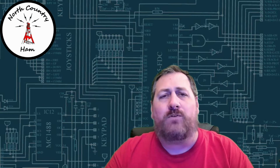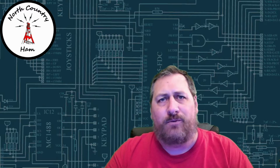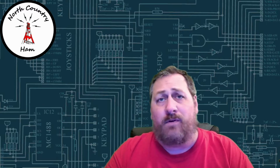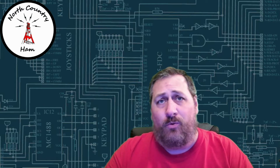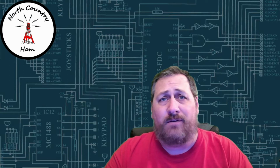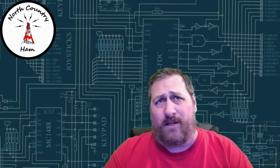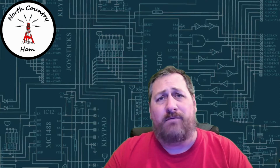The main thing that really needs to get changed with this is the actual power source itself. I do have plans to change these over from a lead acid car battery that's currently in it, to probably a couple different lithium ion batteries, so that way it cuts the weight in half, improves the power cycle, and gives more consistent voltage. I plan on hooking them up in series, so I'll cover that in the video.